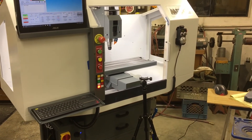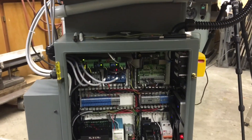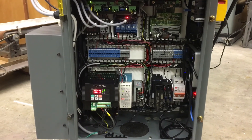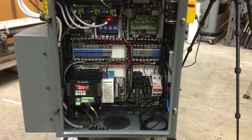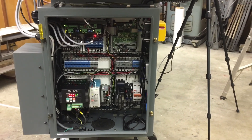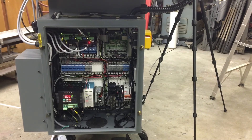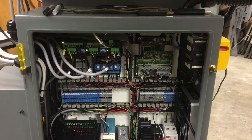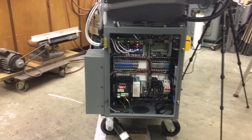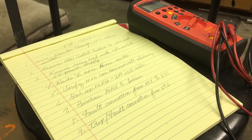So that's the progress on the machine — a little slow, but we're just taking it one step at a time. A couple of things that are still going to happen: I'm going to use the AL-1 and AL-2 alarm contacts on the VFD for an interrupt so you can't engage the power drawbar when the spindle's running, and also an alarm for the VFD if it trips or faults, as well as the fault setup for the stepper drivers. Then there's a list of wrap-up items — a couple USB extensions and so on.